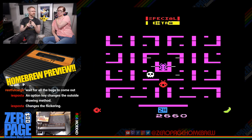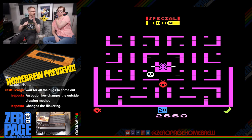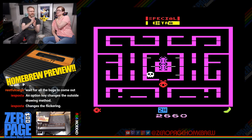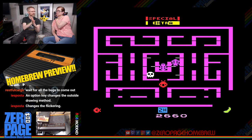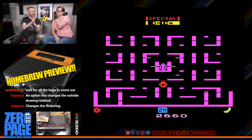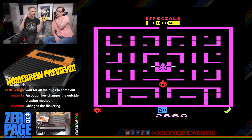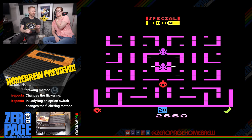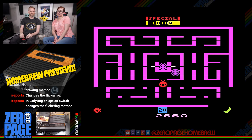You could upgrade so that it can read the bigger cartridges and do bank switching properly to get all the information, because it has to recognize what type of cartridge it is and then go through all the banks of ROMs inside. Banks are 4K, and it has to go 4K, then the next 4K, and read it all in, and then assemble it as a ROM. Send it to the Stella emulator, and Stella runs it. And that's why I can't get some of these bigger cartridge games, because it can't read all the spots on the cartridge.